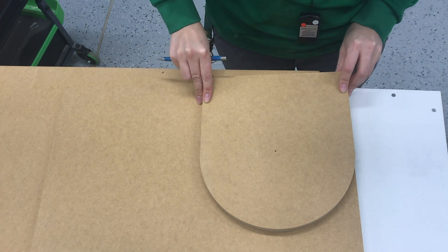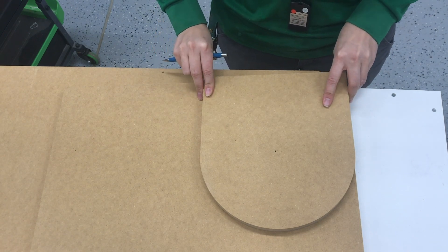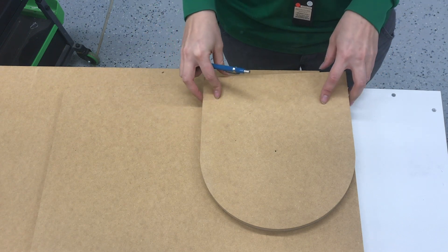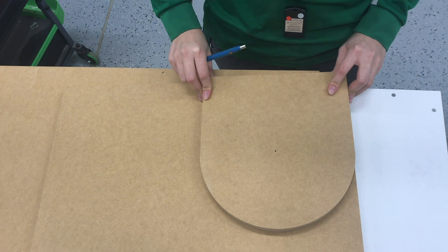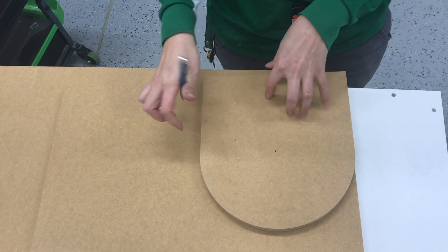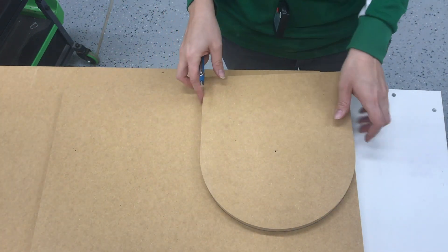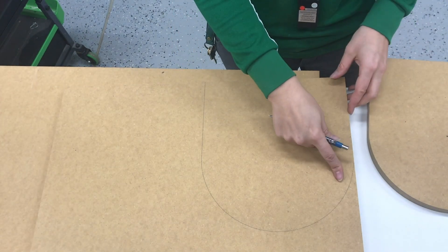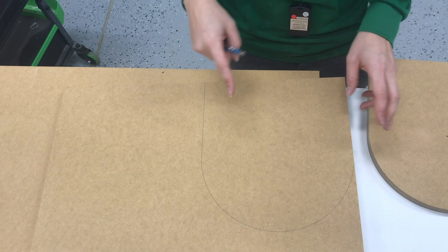For this piece, it's probably only going to be three layers of MDF thick in the end, but I'm going to pretend it will be a little bit wider and duplicate these with the router. I've flushed this up with my fingers on the end on a bigger piece of MDF, and then I'm going to take a pencil and just trace the outline of my template. Then I'm going to cut this out on the bandsaw, leaving about a sixteenth of an inch of waste on the outside.